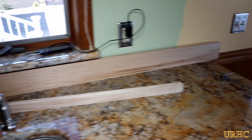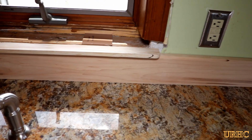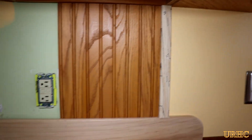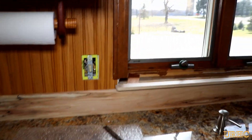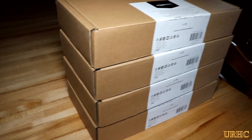Here's that longer piece cut from the lumber I brought in — starting to fit that in place and get the sizes right. I had to put a little step in there for the support I wanted under my granite windowsill. Then it was time to fit in all the oak wainscot, build up that back piece, and space out the outlets. I got it all ready to go, took it all down to the shop, and put three coats of polyurethane on all sides of everything.